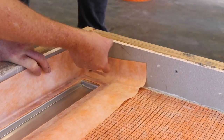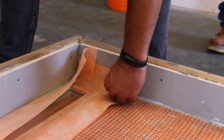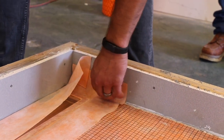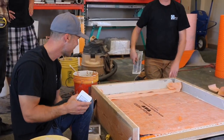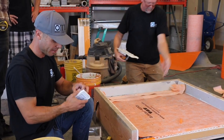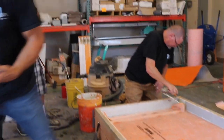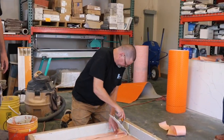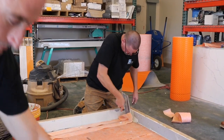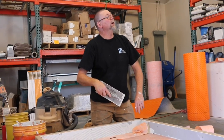This is high enough — we don't need to put an extra piece of band here. You need two inches; this is probably close to two inches. When I bring my wall, I bring it down to the top of this. I still only got two layers. Normally this is the second day after floating, which is important to the advantages of using the sheet membrane. As long as that cure is quick enough, if you're using a rapid mortar bed, you can get on top of it.